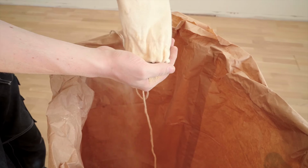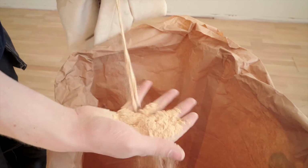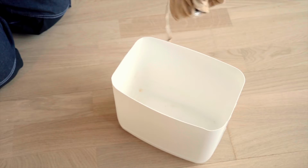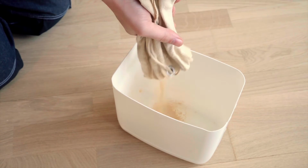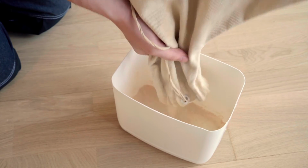If you plan on filling gaps in the floor with a joint filler later, you will need some of the wood dust from the sanding. Empty the dust bag and be sure to collect only clean wood dust. Put it in a separate container for later.